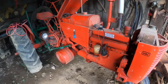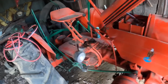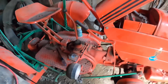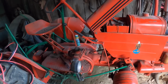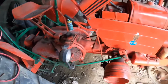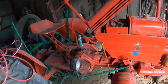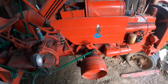So, that being said, one thing that is wrong, as indicated when I looked in this box that I laid on the platform, starter switch is bad. It does not work. Does not make contact. So I used jumper cables to see if my battery was good and jumped from there directly to the starter, and it does in fact turn it over. So we're going to replace the starter switch and I think also this cable because it looks like garbage.